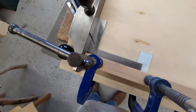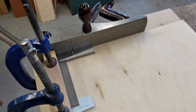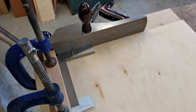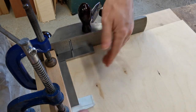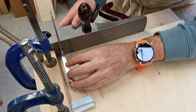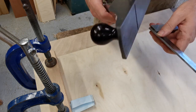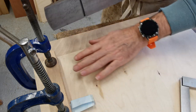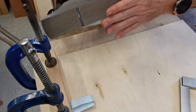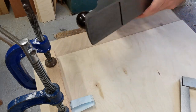The bit that nobody really measures or looks at is once this is all together and done. Let me show you - once you've set this up square, which I have and I'm happy with, let me double check that it's square. And it's not - my plane isn't square. This is the problem: all of this is incredibly accurate relative to this flat surface, but now I'm checking for square and it's not quite square.